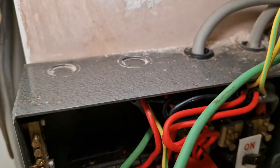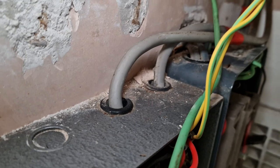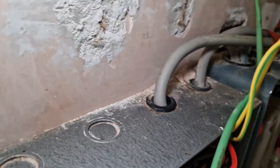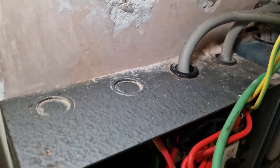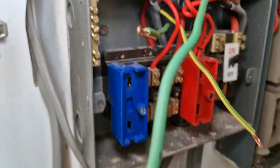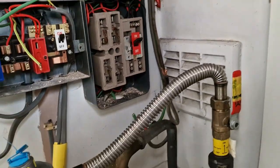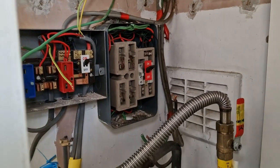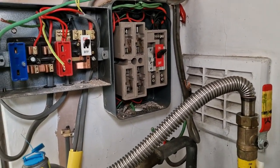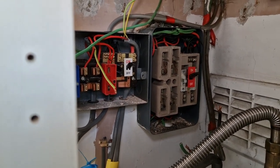If you look at the top here as well, we talk about eddy currents - generally it's not an issue on single phase installs to be totally honest, but we shouldn't be doing it and you can see they've gone straight through there. The load's that low that it's unlikely to ever have been a problem and the installation's certainly not showing any signs of it, but that's what we're faced with. So we're going to strip these out, make sure we've got everything where we need it to be, and pop our new consumer unit on the wall.